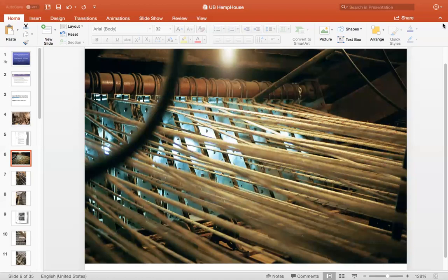A lot of hemp houses just hung battens like a counterweight house. They would hang 40 or 50 battens, and that's where they hung everything from, and they didn't take advantage of the flexibility of the system. But when you're reeving the lift lines through the head blocks, you always put your long line on the top head block, then your long center on the one below that, and the center in the middle block, your short center below that and your short line on the bottom.